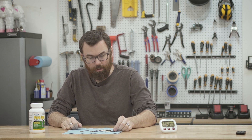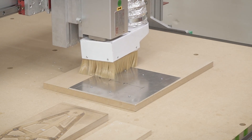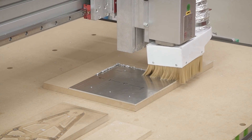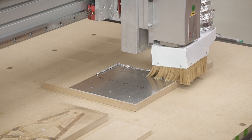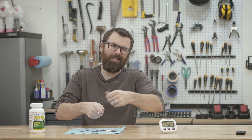I've been meaning to do this for a really long time, but about a month ago I ran into an oopsie on my Avid CNC where I messed up the coordinates and took a quarter inch end mill and did a hundred percent engagement full depth of cut right through a block of aluminum — it basically stir welded the whole way through. It was a really nasty cut and the end mill was brand new and just completely coated in aluminum chips. I got some of the gunk out of it but we're going to see how well the lye cleans it up.